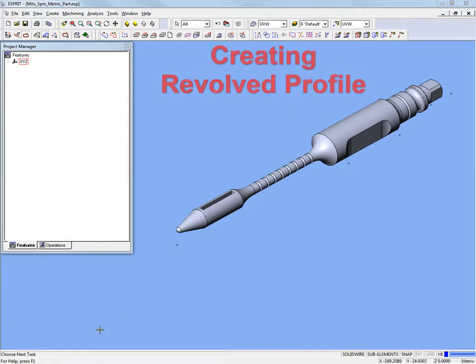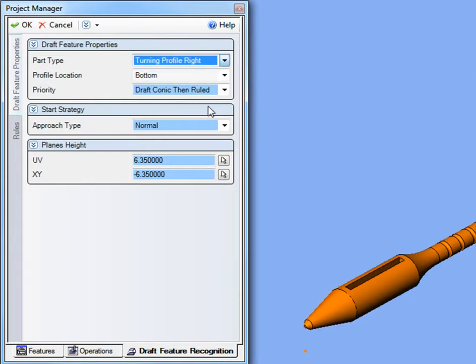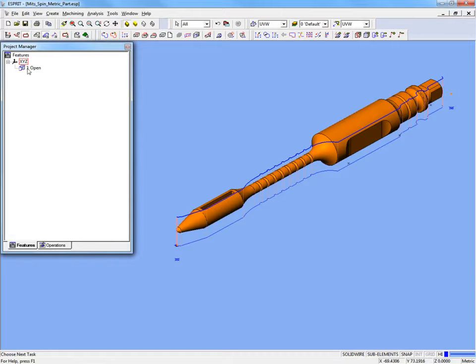With spin and burn, the workpiece spins around the rotary axis while the wire cuts a two-axis profile. Small, dynamically balanced parts that require a high surface quality can be cut with high-speed erosive turning. The absence of tool pressure allows for minimal diameters.